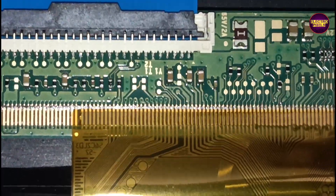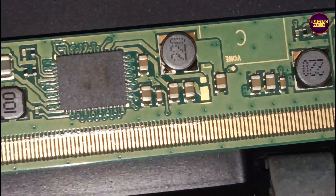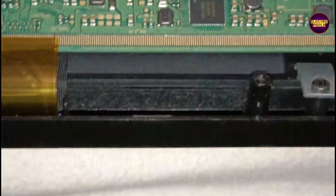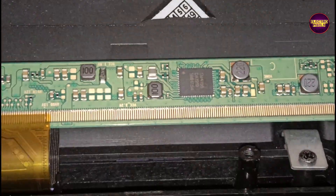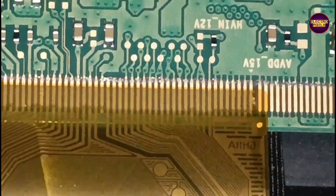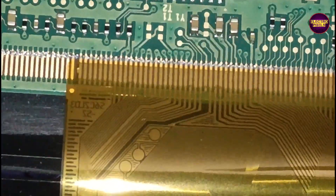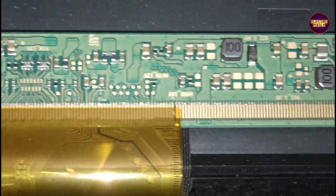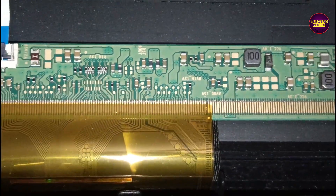Here in this TV a single CoF Samsung panel is used with the SM4186 DC/DC IC. Due to internal shorting in the gate signals, the SM4186 IC goes into protection mode and because of that it doesn't generate the panel basic voltages.